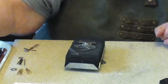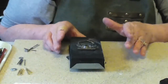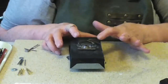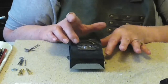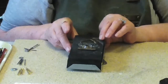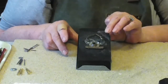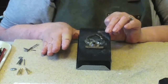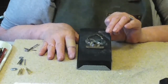And I'm going to solder this face, which, if you can see it, looks like a face to me. I've sanded off parts where it's going to be soldered, except I didn't sand up here with the spring, and we'll just see if it takes it all. But I've sanded the other parts down to where I got shiny metal, so that hopefully that solder will stick. I've left parts of it with the rust and the natural patina because that's really how I like to see it rather than shiny metal. The silver, of course, the silver solder is going to be shiny.